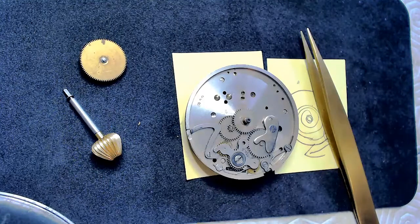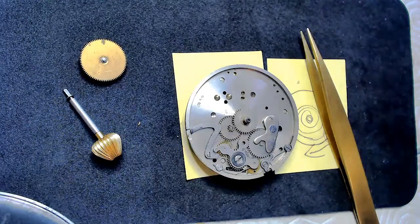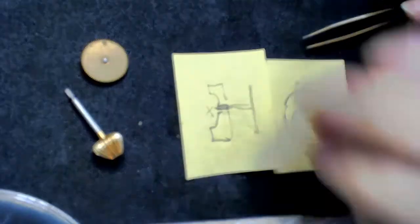There's some discussion about what happens when oil gets old — my expiry dates are generally good. I don't think it matters much for a pocket watch if the oil is a little old, but if you're working on a high-end Rolex, make sure the oils haven't expired, because they will turn into something else over time. My D5 is from 2017, but it's for the heavy-friction keyless mechanisms and looks pretty good still.